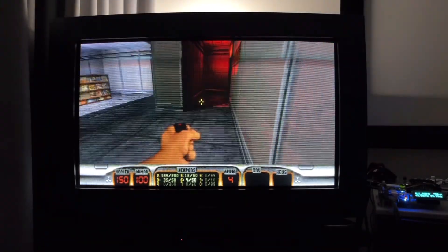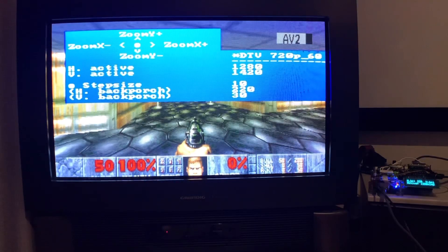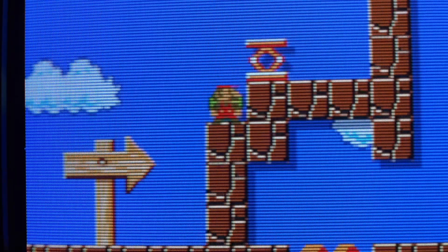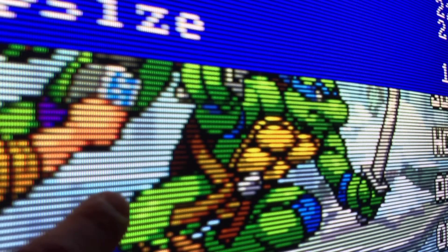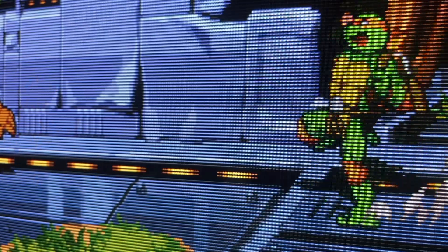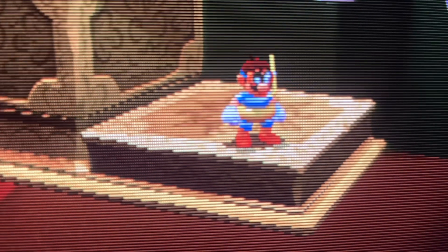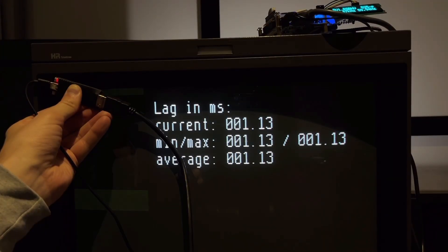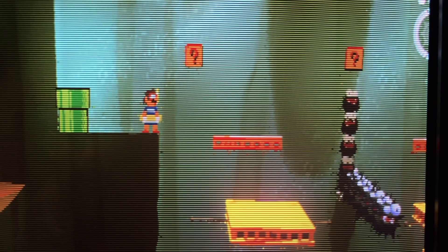Yes, it outputs 240p and 480i, can accept a 720p input, is fairly low latency, and has great picture adjustments and presets. But feed it anything other than 240p upscaled video and you've bought yourself a one-way ticket to Shimmerville, capital of Jagged City. I really was expecting line deletion to trump the other downscalers I've tried, but I'm now seeing the benefit in line blending instead. My hopes for future firmwares lie in addressing the 480p RGBHV input for that lightning-fast downscaling in line multiplier mode, and although I'm sure it's a lot of work, an option to line average as well.